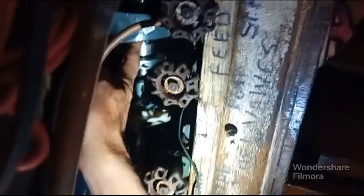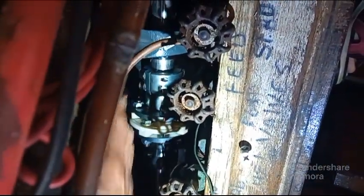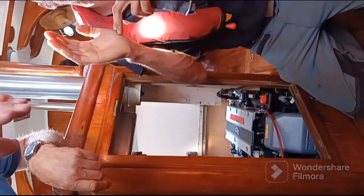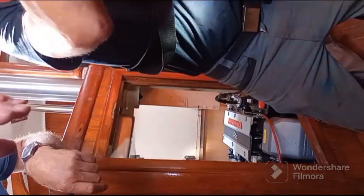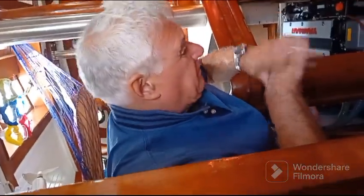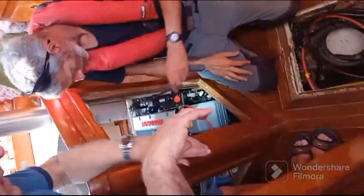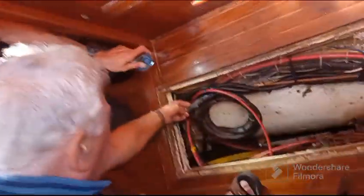Here, I don't put the screw here. Because why? When you are forward, yes, you need to translate a little bit. See. And the first time I put the screw, the bearing torqued a little bit. And when I see that, I say, I don't need to. So the little screw was here, I think, or in this hole. But don't put it because the shaft needs to translate a little bit. It needs a bit of movement. Yes. D'accord, okay. I cannot remember what that was for. It was an old...